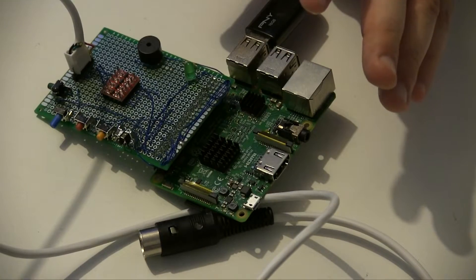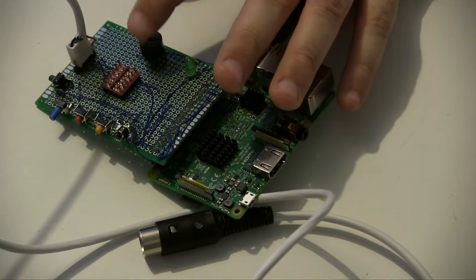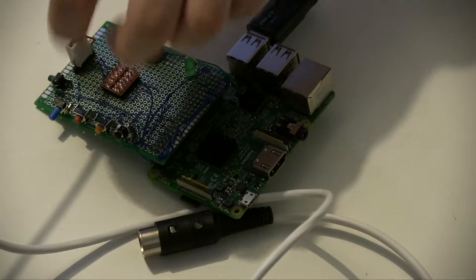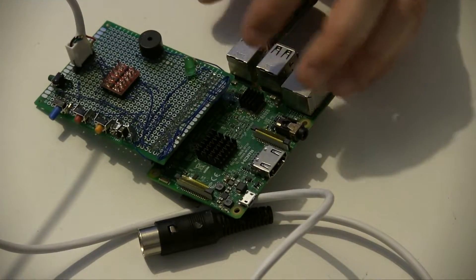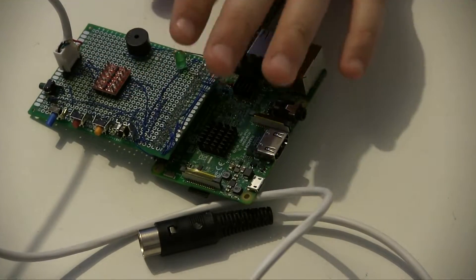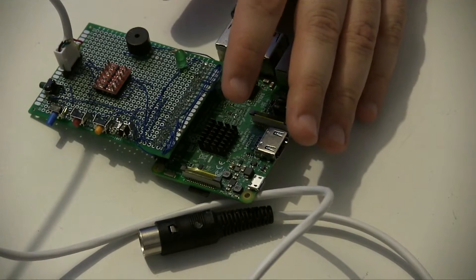You can just go to eBay and buy a Pi 1541 — there are schematics available just to make a PCB. We are in fact doing our own one with more options, including a DIN 6 plug so you can have pass-through for other devices. Once we've finished and tested it, it will be open source as all of the Reinfuse stuff is. Building one yourself is definitely possible — it doesn't require a great deal of skill, just patience and time.